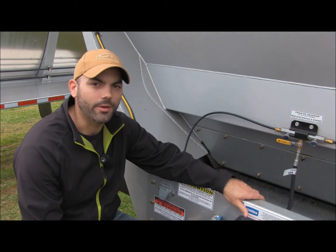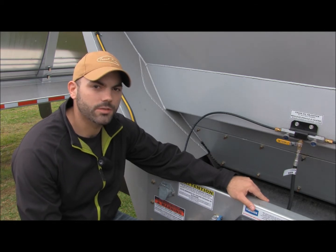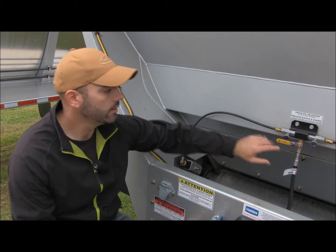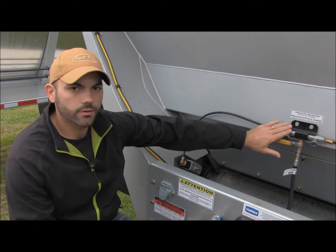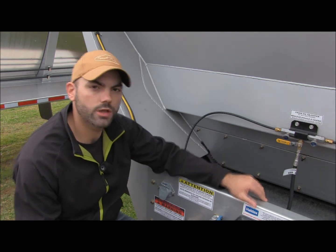Hey, it's Kevin here from Trout River. I'm here today to talk a little bit about maintaining your oil system. It's a pretty simple system. It's drawing oil directly from your return line, up through a ball valve, through a throttle valve, down through a line, into your brush, which is in contact with your chain on both sides.